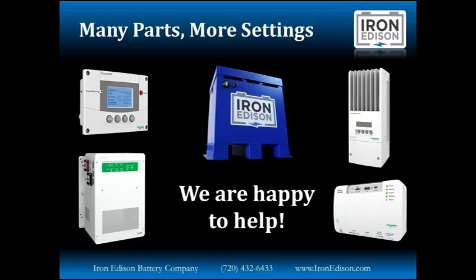We can parallel a couple of these units together, but there's definitely some restrictions on the way that the Tesla Powerwall is installed. For example, the Tesla Powerwall is typically tied in directly to the main load panel. If the grid were to go down and the battery takes over, that one or two Tesla Powerwall batteries could be drained very quickly, especially because we're not putting in a critical load panel into the design. Essentially, every circuit of the house is going to be backed up by a small battery. In houses with an air conditioner and a couple refrigerators, you would be able to drain that Tesla Powerwall in just a couple of hours.